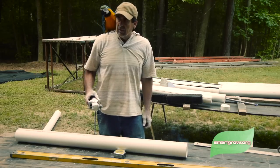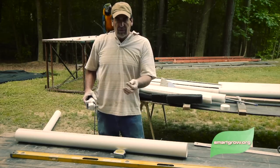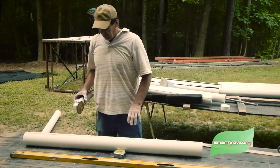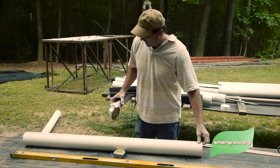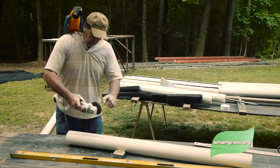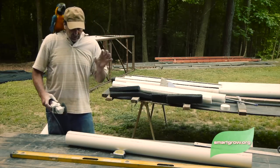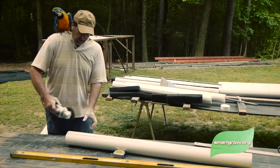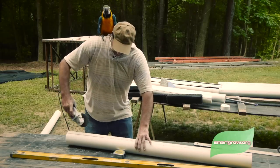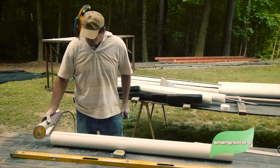You'll notice this grinder only puts out a fine powder, so I'm not even putting on safety goggles — don't tell OSHA. I've got one side cut, now I'll cut the other side. Be careful: this particular grinder likes to pull to one side. Always keep your hands out of the way because if it grabs, it could go across and catch your fingers. It's best to grip in front of the grinder since the force wants to drive it back.